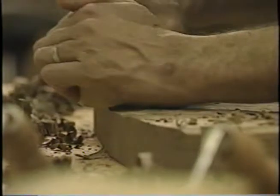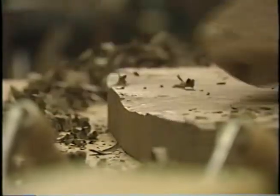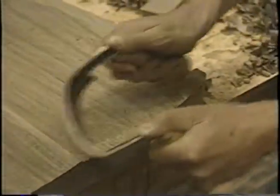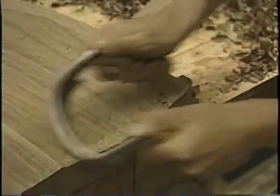Make sure to deepen the fronts of the leg hollows. I carve mine at least 1/2 inch deep. This is comfortable on the backs of the thighs. When I'm satisfied with the roughing, I move on to an inshave, also called a scorp. This tool has a much bigger radius and cuts down the ridges left by the plane.